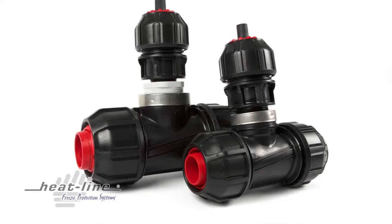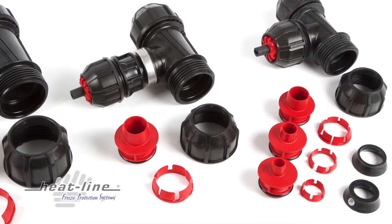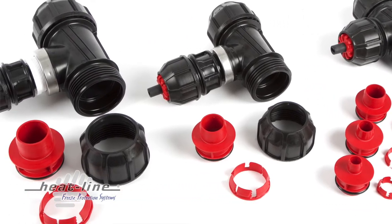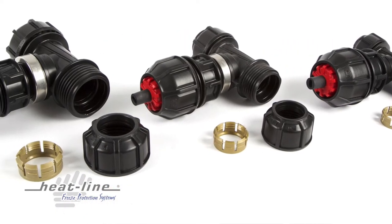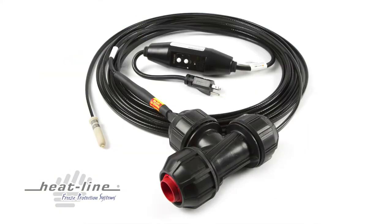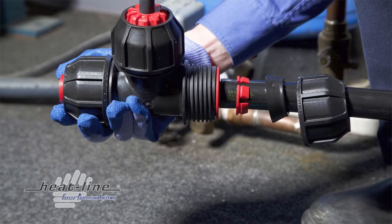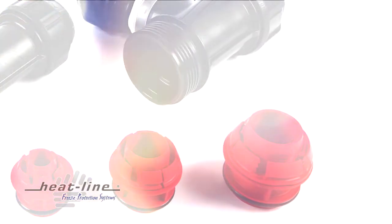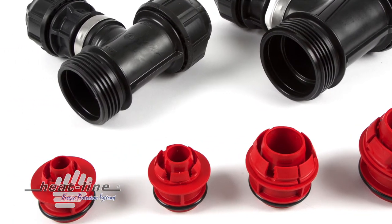Further benefits of RetroLine include its ability to be ordered and adapted to a wide variety of pipe diameters ranging from 3/4 inch to 2 inch internal diameter. It is also available for CTS, copper tube size pipe. The RetroLine does not need to be fastened at the downward end, rendering it fully serviceable, which means that in the event of a concern the cable can be removed, checked, inspected and reinstalled. The most common way to interface a RetroLine is with compression fittings that are included with the system.